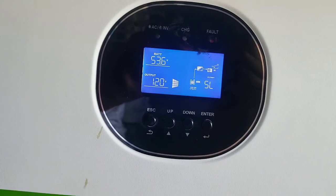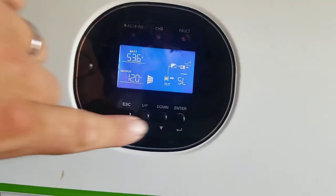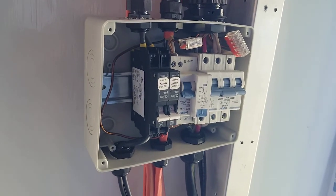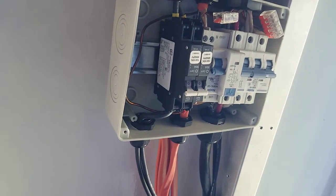Now, right now when there's actually solar power coming in, which is indicated by a line going from there into the battery, the inverters will actually stay on. If you want them to fully power cycle, it is necessary to flip off the AC power and the solar power. So you cut off all sources of power to the systems, and then they will finally turn off.